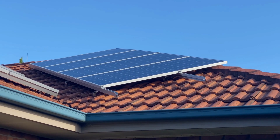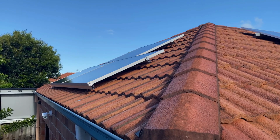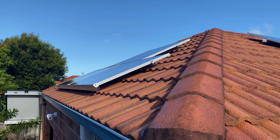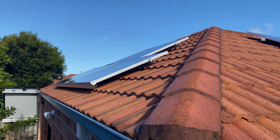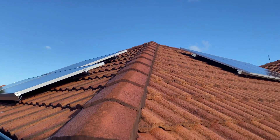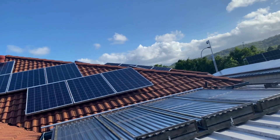So there's the first one — a little northerly there, single string. And this is the other string, the little 3-panel string — it's another northerly. So they're both northerlies, which is good, it'll be more efficient. This one will go into one of the MPPTs in-built in the Primo, and the other one over the other side going to the other MPPT.